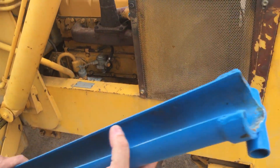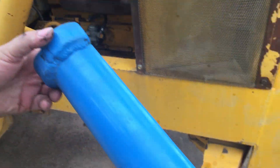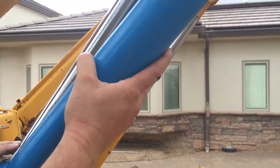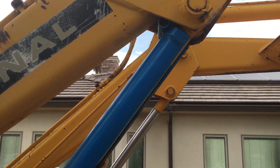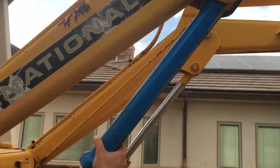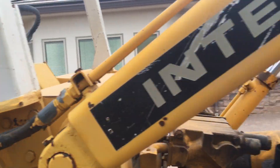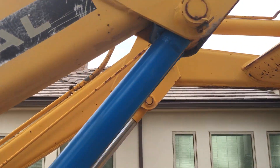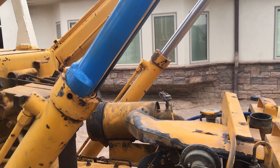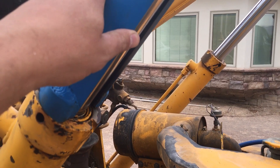You can see we took this 3-inch pipe, welded some dog ears on it, made it a little thicker at the ends, and we welded this pipe here. As you can see when we put it up onto the machine, the pipe goes up there and prevents it from spinning out. So we're going to let the pressure off — all pressure off the loader. So now it's a much safer way to work with the hood off. If you have to let the hydraulics free and let the fluid out, you can at least get under here and work, or even just move the tractor around.